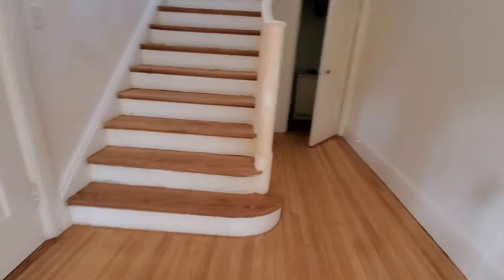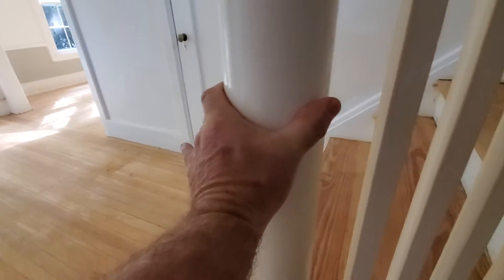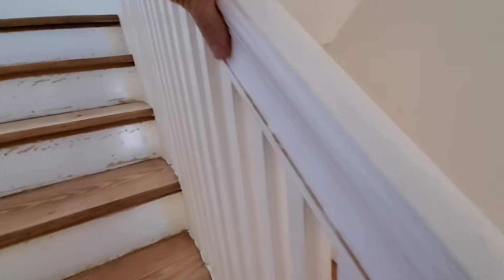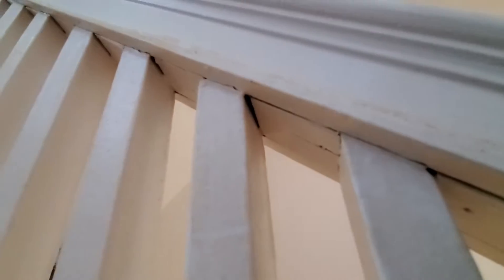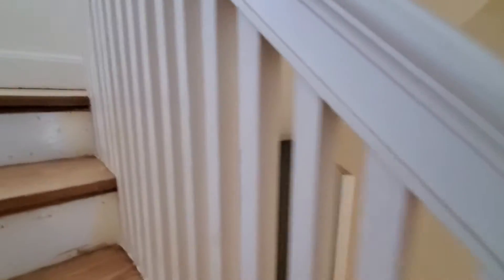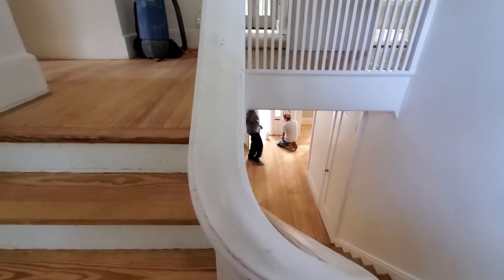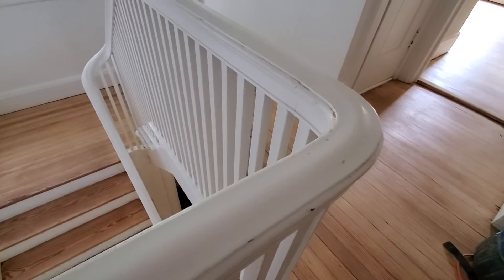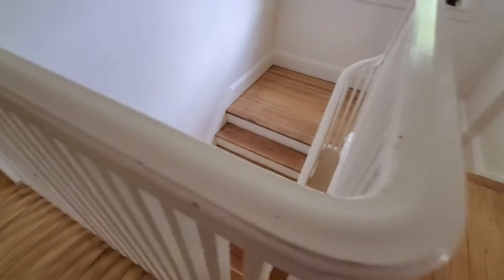So the handrails — this is what we would sand if we did the handrails. We would sand this down to raw wood, but pretty typically we do the post and then sand this. Underneath, there's no practical way of getting that white off, so we sand this but leave the white underneath. All of this top surface is probably going to be maple — they usually are. If the customer chooses, we'll sand this and finish it to match the floors, whatever design scheme they have. Usually the handrails are a little bit darker than the floors.